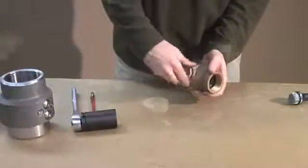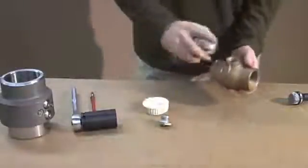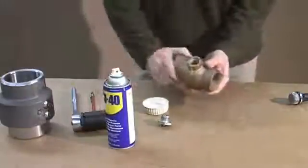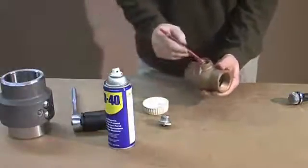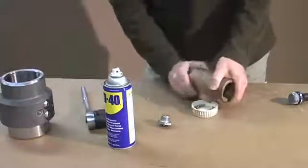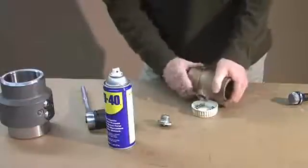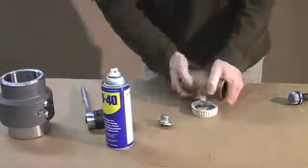At this point, you'd use your degreaser. Continue to rotate to break down the grease inside the joint, and then you can start to pull the ball bearings out. This is where the magnetic pen is going to help remove the ball bearings. With the grease broken down, you can begin to remove all the ball bearings. You'll just have to keep working the swivel back and forth until all the ball bearings are out.